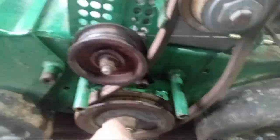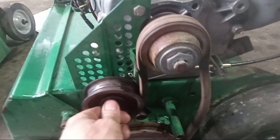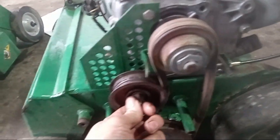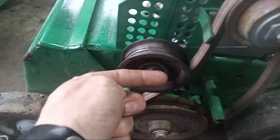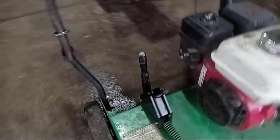That in return will start your rakes underneath. If the belt is too tight or too loose — if you're pulling back on the handle and the belt is still not engaging — then you need to adjust these so that you can have a farther pull back. That should help with belt engagement.